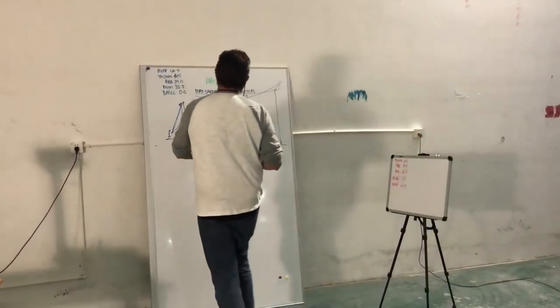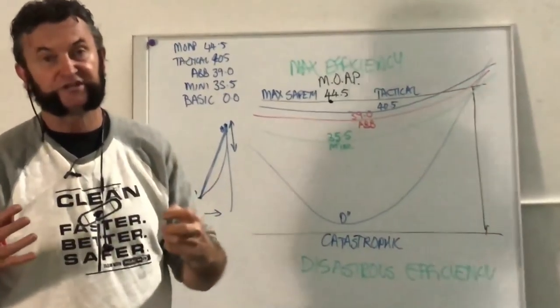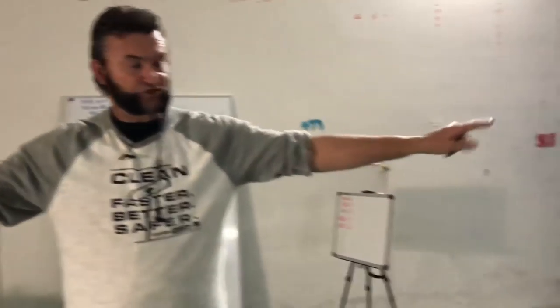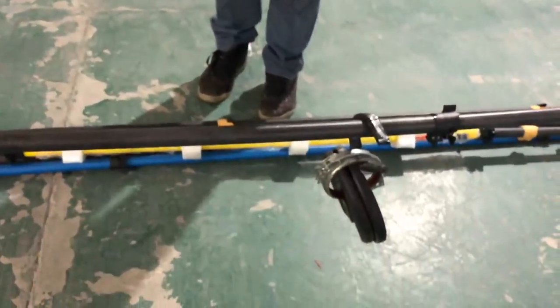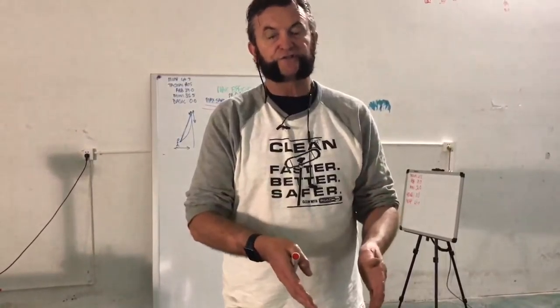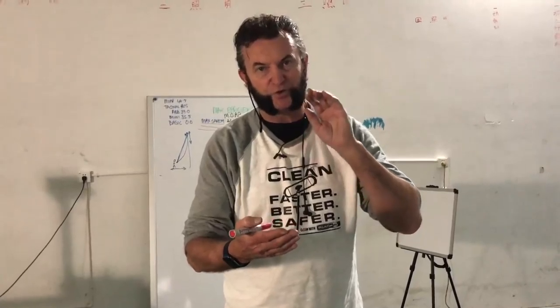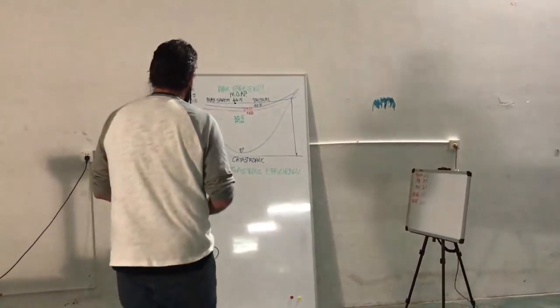So when we look at the value of a pole, what's really exciting is that at Reach It, we're in the throes of developing a trade-in program. So this is why you want to do this. You go out and get a weight, a 3-point test, 2 points at the same height, a weight in the middle. You tell me the weight that you used, and we can replicate your maths, and then we can look at the flex on your pole and give you a trade-in value on that pole.